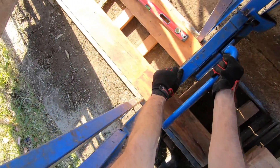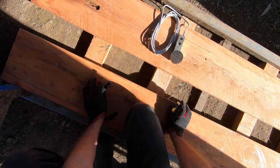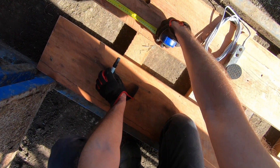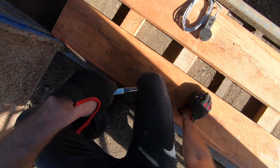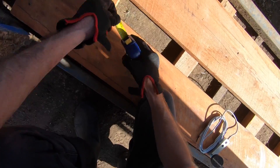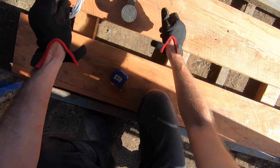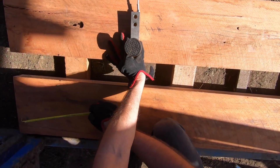I'm going to be able to put the animals in there, get their weight nice and easy, let them out, good to go. This platform is 2.04 meters long. I'm going to want to put that first 2x4 about 200mm from the end. You can see the 2x4 is now about 200mm from the edge. Now we're going to mark up the load cells — you want the edge of the load cell about 75mm from the edge.